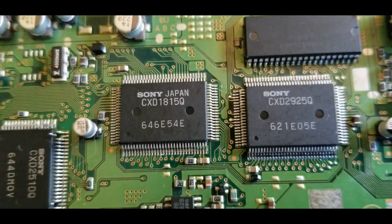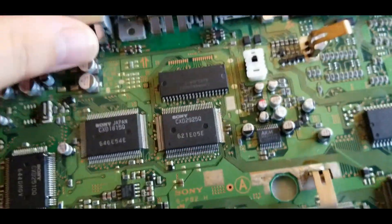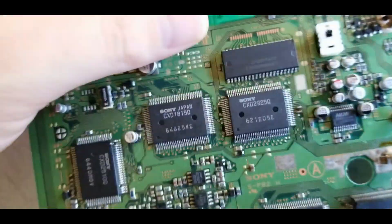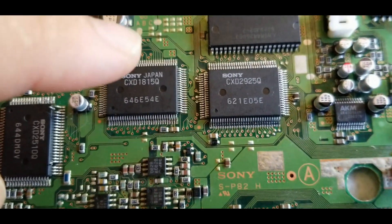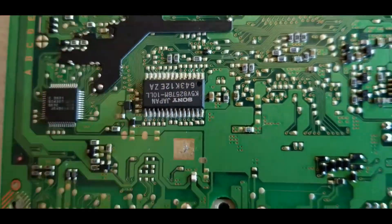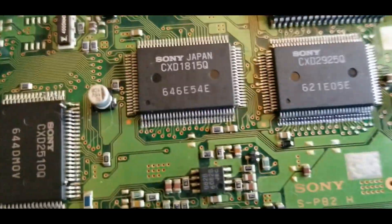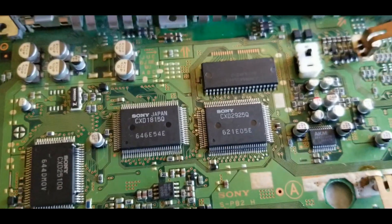This is the board I'm trying to fix. I believe I'm going to start by reflowing this chip and reflowing the RAM for it, seeing if we still have an issue. And if we do, I'm probably going to swap the RAM first just because it's going to be easier, then swap the chip and see if I can get it working.